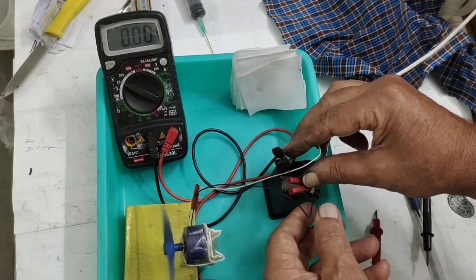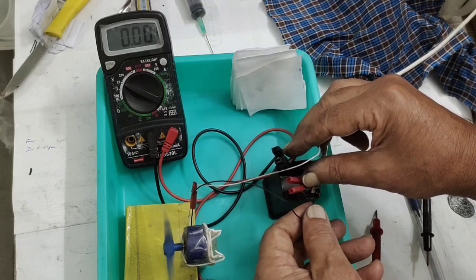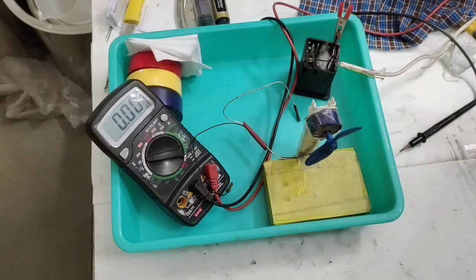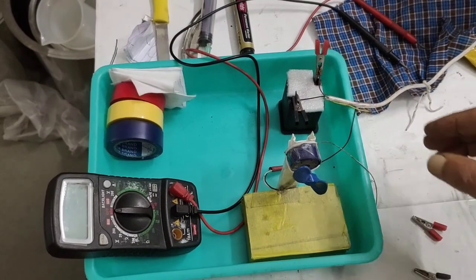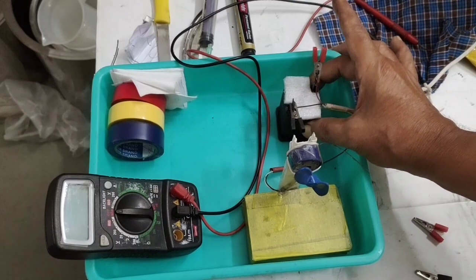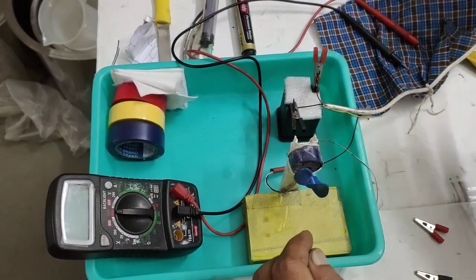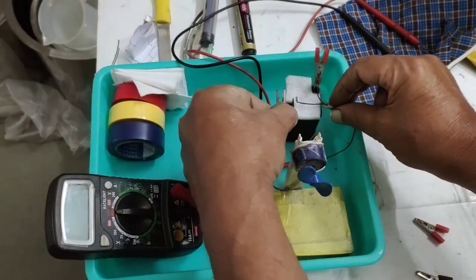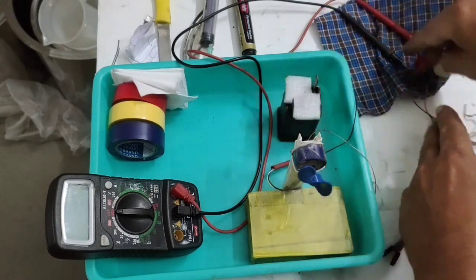You are adding more carbon at the negative side; the positive is only lead oxide. We will continue the formation method. After charging for 10 minutes using 30% sulfuric acid, I am going to switch off the DC supply and remove those connections.